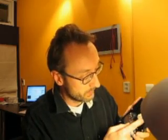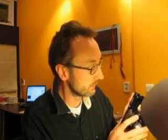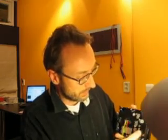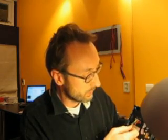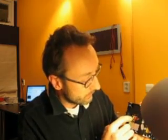I was hoping to find a stepper motor and a wicked fast direct current motor. But this is not a real stepper motor — this is a so-called voice coil actuator. More on that later. And this motor is not exactly direct current. It has four leads — two too many. Turns out this is a brushless motor and it takes three sequenced pulses.